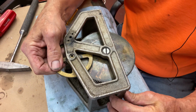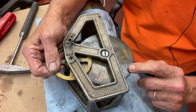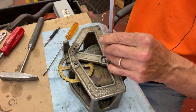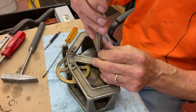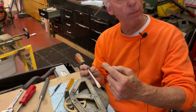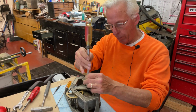And you see how that moves, wiggles? So that means this gear is wiggling on this gear here. But on these phonographs, this screw comes out lefty-lefty, okay? Now you have to realize the other screw is gonna come out righty-righty. It's gonna be a left-hand thread, so it's gonna come out the opposite direction. And I'll pull this one out, but I gotta put it back in.